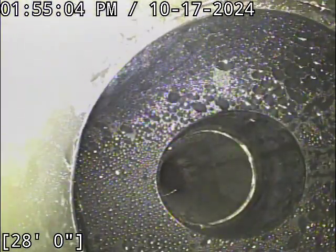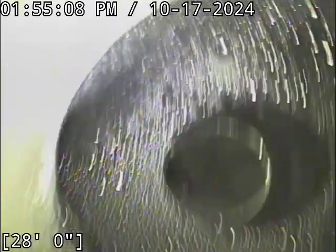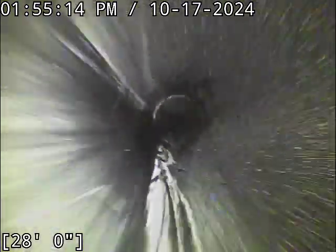We're going backwards right now. This right here is the vertical dive as the line dives down to exit the foundation of the house. This is where the pipe necks down to a sink drain. So we are back inside the house at this point. Very nice looking sewer line. Good flow end to end, and everything from that point forward is all back in the crawl space area.